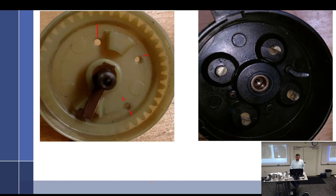And guess what, magneto, guess which rotation this one was? You can see all the scratch marks. Yeah, so this was a left-hand mag. But then somebody got the pin. Then you have to take the whole thing apart and straighten the pin out to get it out.